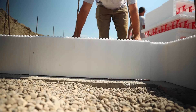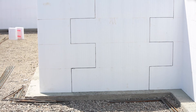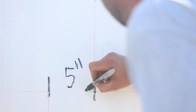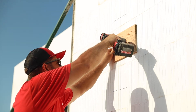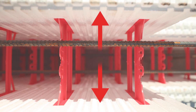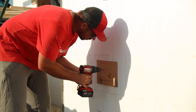Joint options: As an installer, you have two options for cutting the filler block. The most common option is the overlapping joint because of our 1-inch cut line. If the joints are less than 8 inches from each other when the block is cut and overlapped, they'll need additional form support with wood to resist concrete pressure. Place a mark where additional form support is needed so it's not missed as the block is stacked. Superform has great strength to resist concrete pressure perpendicular to the wall because of 6-inch tie spacing and corner ties, but the 12-inch overlap is what gives Superform strength to resist parallel concrete pressure. If adequate overlap is missing, forms need to be additionally supported.